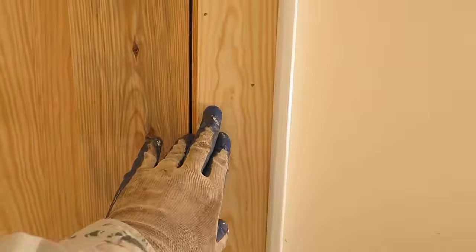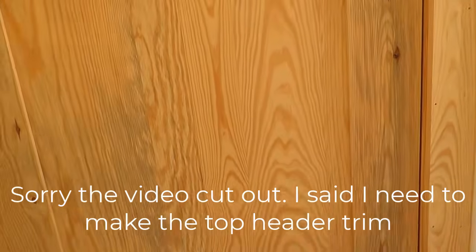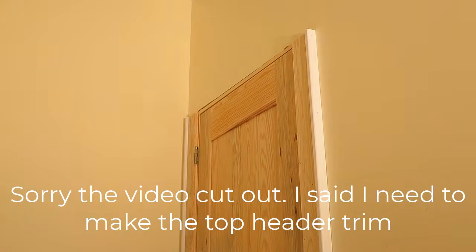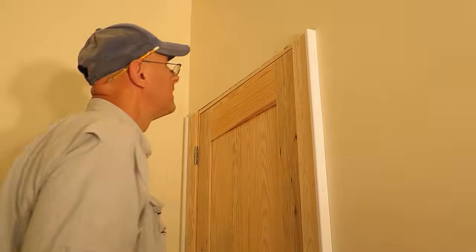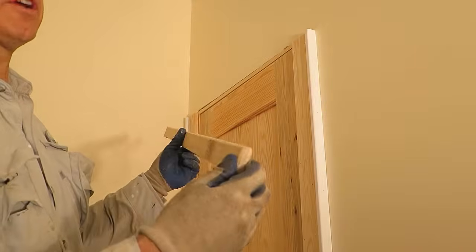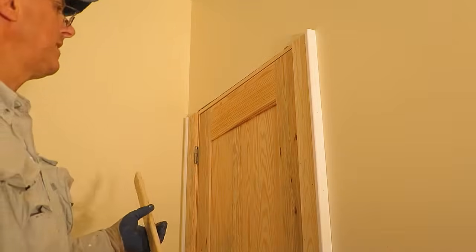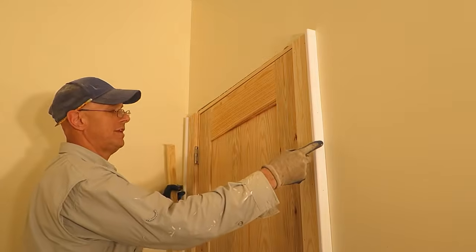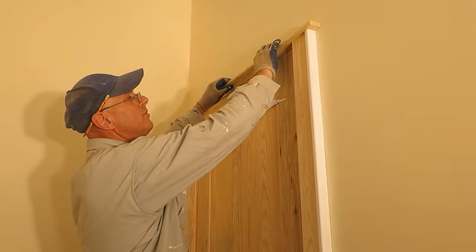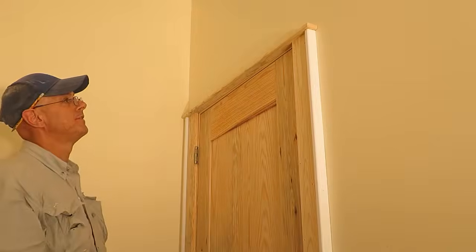With the flat edge on, as you can see, and then this. And so my next step is, okay, let's do the last couple steps. Now, this piece here is just a 5/8 of an inch. I've ripped it down. It's just a regular piece of pine, ripped it down and rounded it over on each end. I made it the length between these 2 pieces, and I added 1 inch. And the reason for that is so that when that steps on, I've got a 1/2 inch reveal on each side.